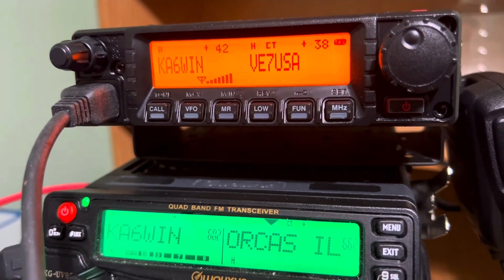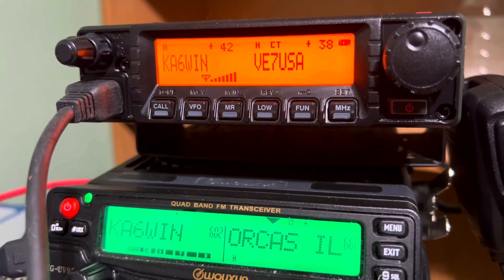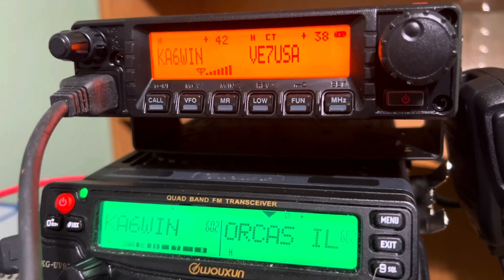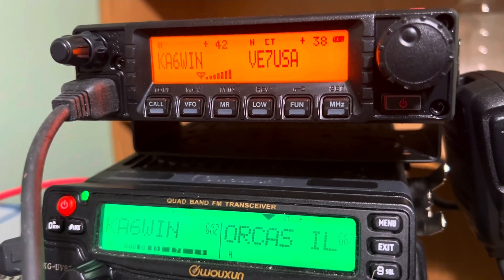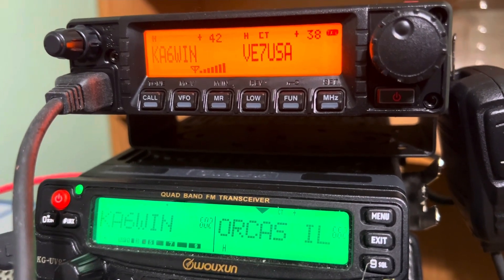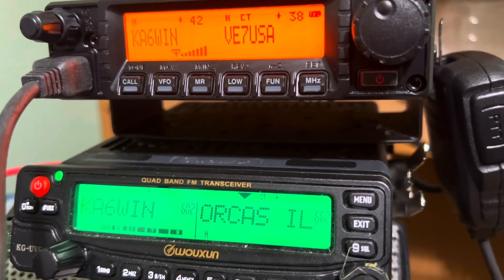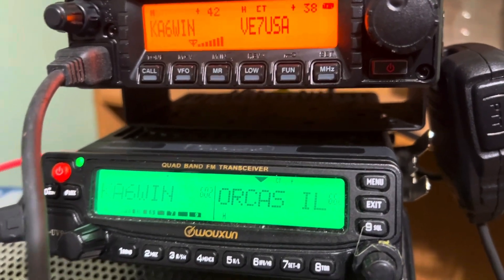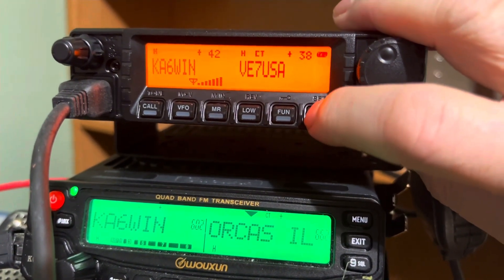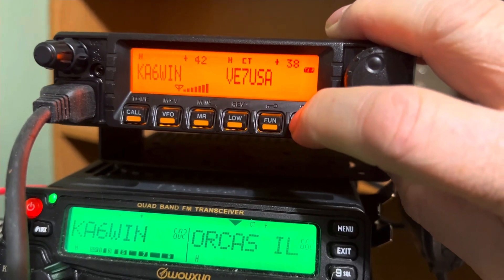That certainly helped metropolitan areas with a lot of intermod, particularly on two meters. It's both ways. Pretty nearly all repeaters these days, you've got to send them a tone signal in order to open their squelch, just to keep the repeater from hearing interference. And a lot also send you back a signal to open your squelch so that if you're in an interference-prone zone, you don't have a lot of problems as well. Every repeater that I've got does do both — 100% across the board.